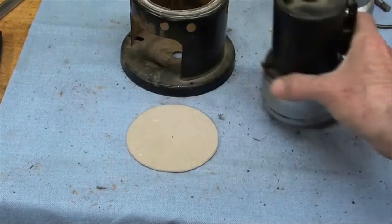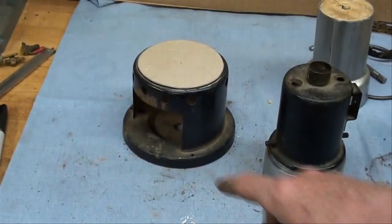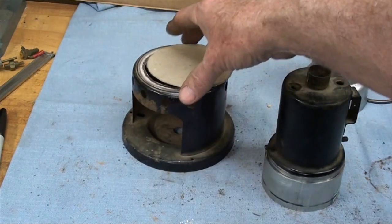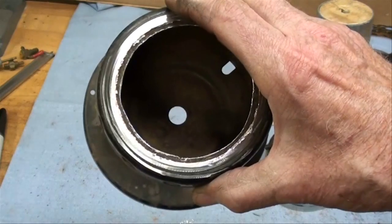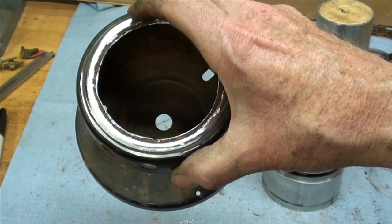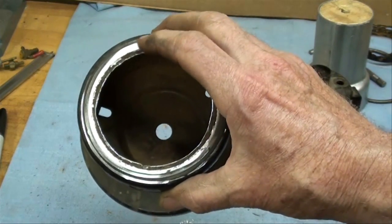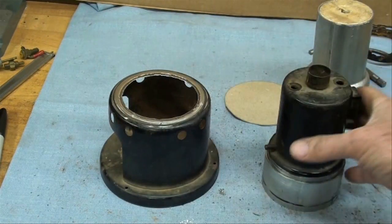The reason for the extra lip sticking out around the outside is that I need a way to fasten this onto the firebox — possibly a couple of little rivets or screws. I may have to make it a little bit bigger, but I don't want to infringe upon this radius here, which I like the appearance of. After grinding it, there's a little ring of copper all the way around, which I believe means it was silver soldered or brazed together originally — they would not have used soft solder; only an insane person would soft solder a boiler, even a low-pressure one.